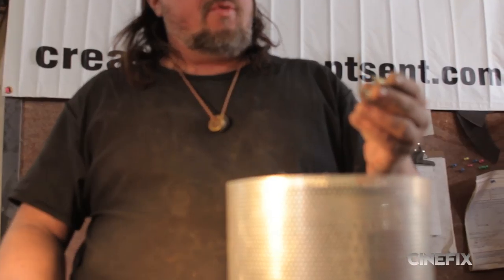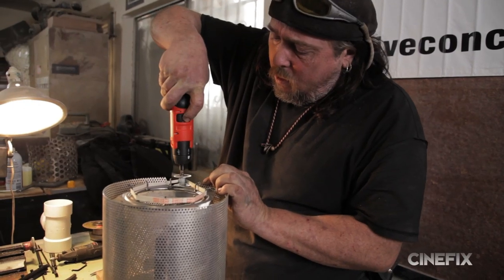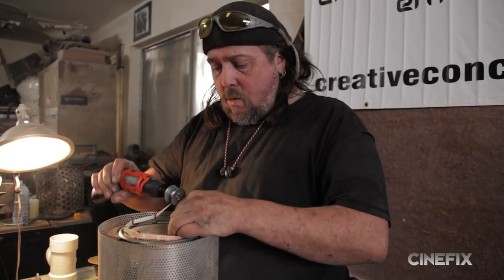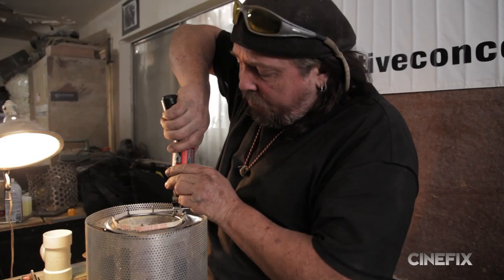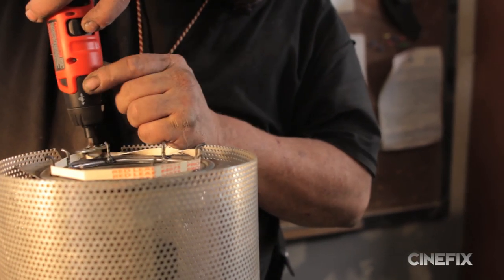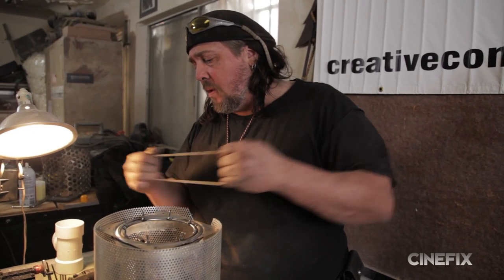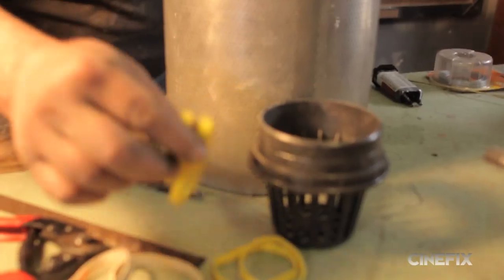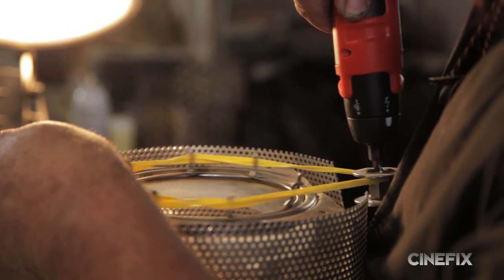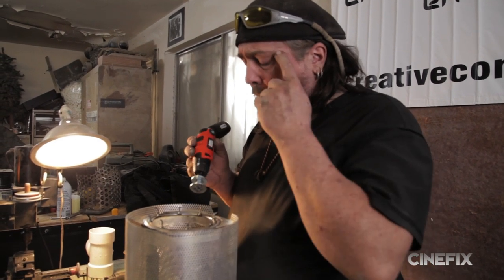I modified this screw tip. This is our driver system. It's slipping. We might have to go around it twice. We may have to go with a harder drive belt, something that's not so stretchy. The rubber band is giving too much. The rubber bands didn't work very well — they just stretch a little bit too much. You need more of a direct drive.